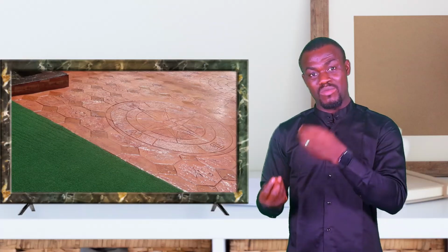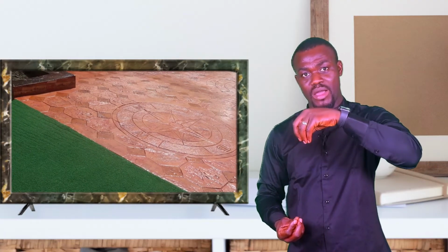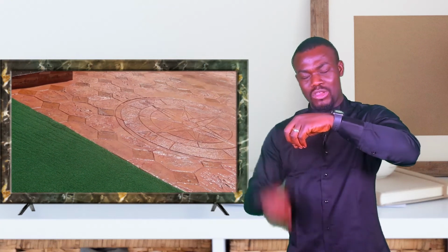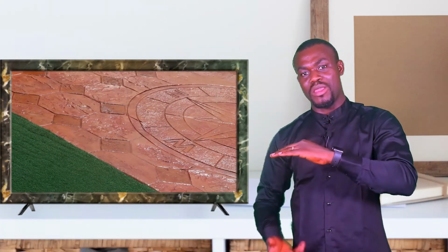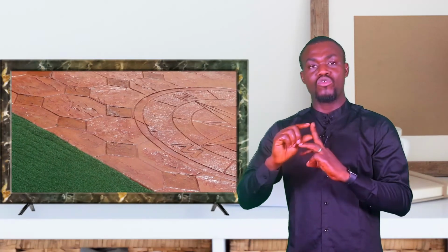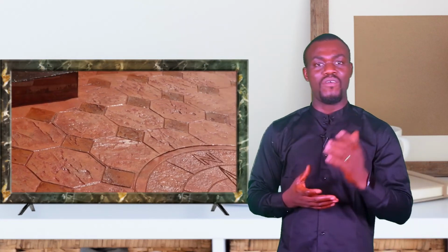What we refer to as biscuits in construction are actually cubes of concrete that we use to suspend the rebars or the BRC. You place them on the earth and place the rebars upon them such that the rebars will now be suspended. You have like a 1-inch clearance. Usually biscuits are like 1.5 inches in thickness. So when you pour, your concrete can go underneath the rebars, seep there, and actually be there. So you have sufficient concrete cover over your reinforcement, your ironwork or your BRC, whichever one you're using for that project.